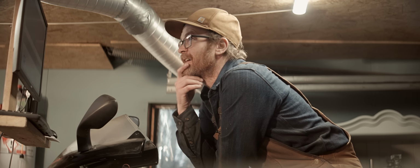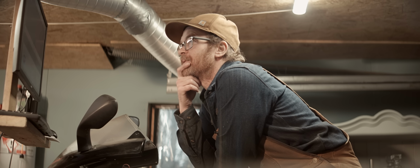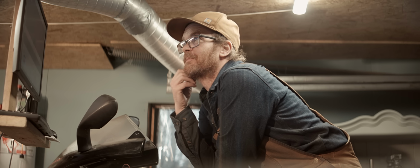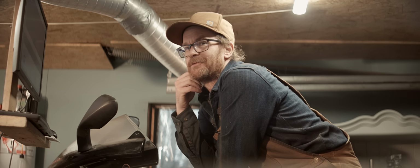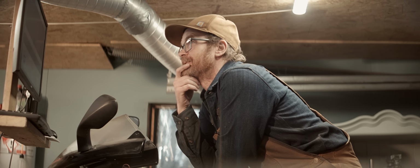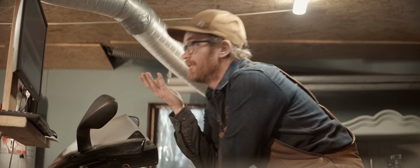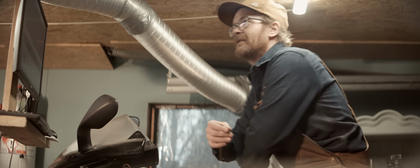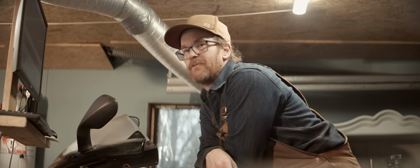On the minus side, we're not making any power at all. The best run here was 5.6 horsepower and almost 2.6 newton meters of torque, which is basically nothing. And even if like 50% of the power went into my belt primary here, it would still not be more than like 11-12 horsepower.